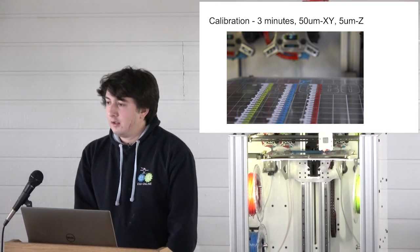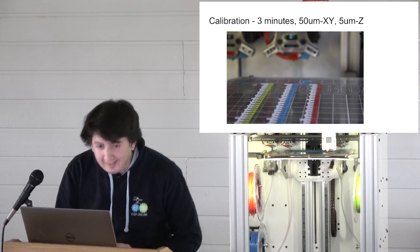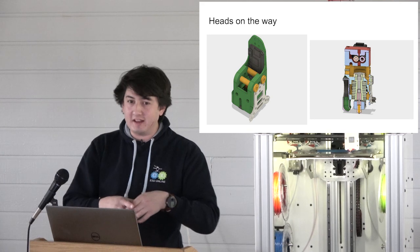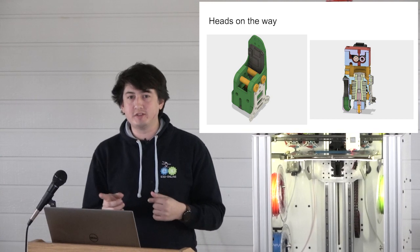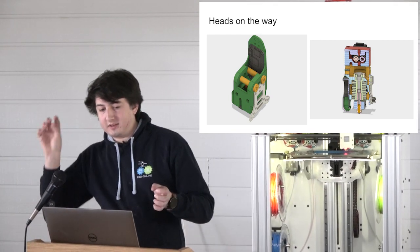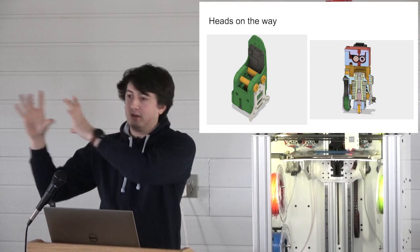What if you put a camera on one of the tool heads, since the big box print bed already has? Nearly there. Okay, head's on the way. This head is the camera tool head. It has a Raspberry Pi in it, and it has a macro lens. Because the motion system moves and this tool head is light, within about 3 seconds we can go grab the tool and take 6 images, because it's a 300 by 200 bed, so we take 100 millimeter shots.